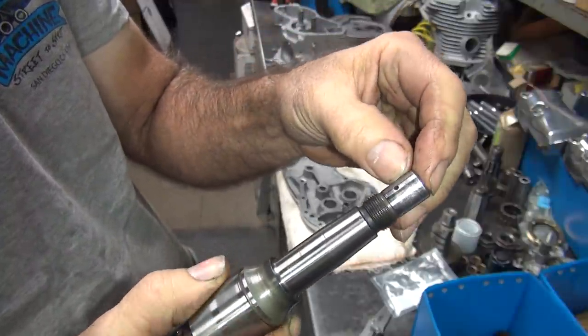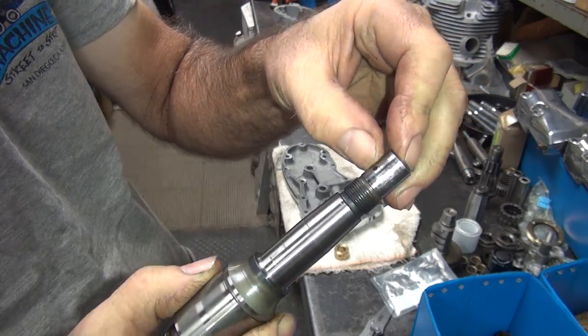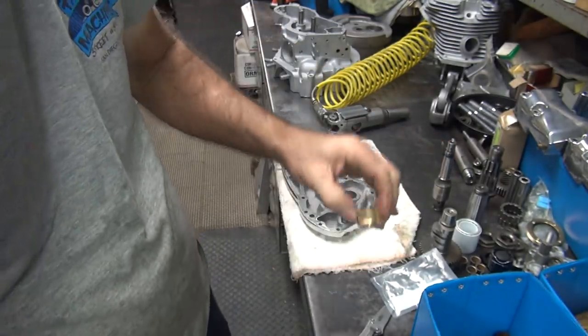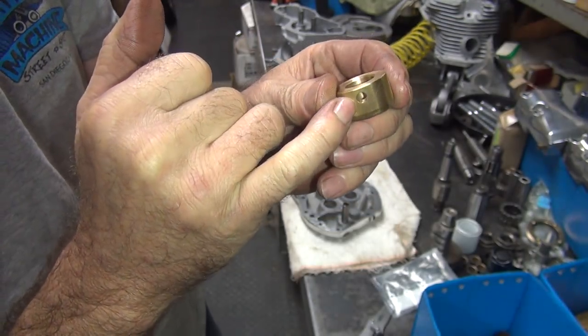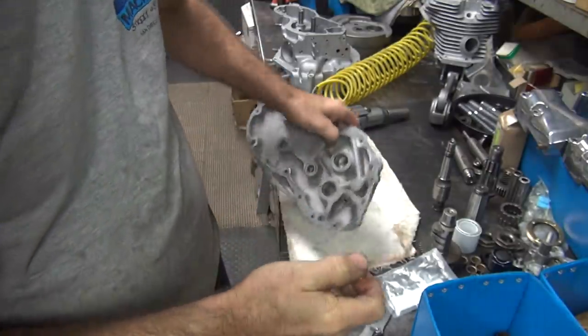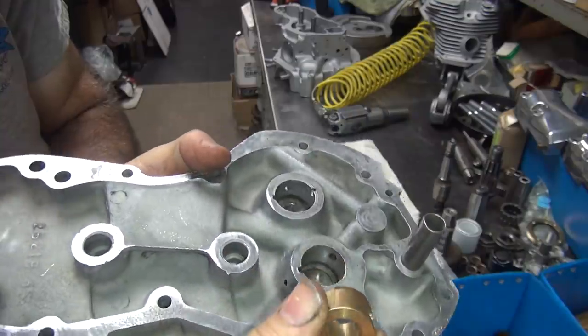When you put these in you have to make sure you put this groove right here where the oil groove goes, so the oil will get to the end of the bushing — that's if you want to have an end oiler. That's where the oil goes down to the center of the shaft. This shaft here is plugged — it only oils to the side here, a side oiler. I'm going to hone this shaft a little bit, it's got a lot of metal through that thing. Now when you have a side oiler instead of using the end oiler groove, you go over to the side oiler hole and line that hole up with the other one.